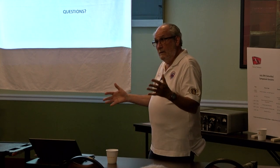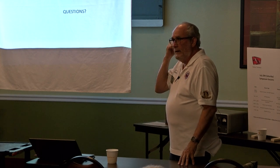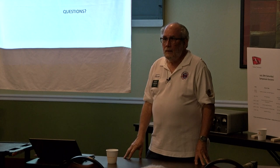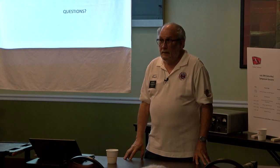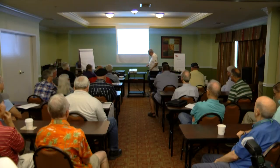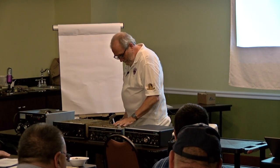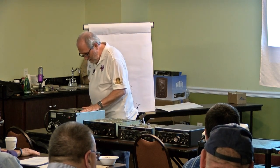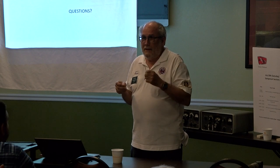I tried the Drake sideband reflector and they said the same thing — nobody has parts. The best way to handle parts for a Drake radio is to go to hamfests and buy another one. It pains me — I have nine TR-7s and I go up to them and say, 'Everything is going to be okay.' In my estimation it's good to have a couple of sacrificial radios of whatever you're working on for the rest.